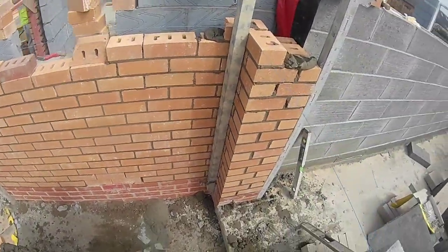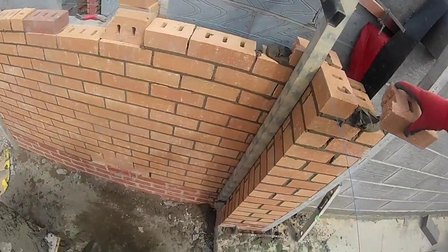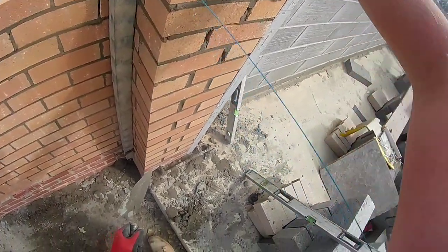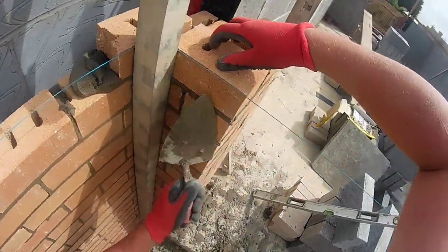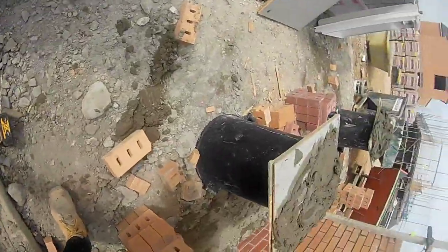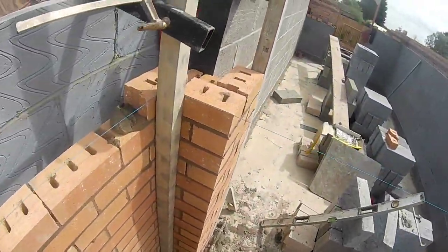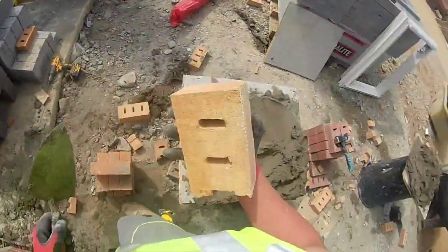As long as you take a bit of extra time pointing. I got pulled up for my pointing years ago, not topping and tailing these and laying them wet. We used to chuck them up because managers weren't wandering around with 6 foot levels years ago, checking up on your work, they just wanted the houses building. So you could get away with a bit of your brick leaning, up to a point, but now you have to be dead on it.